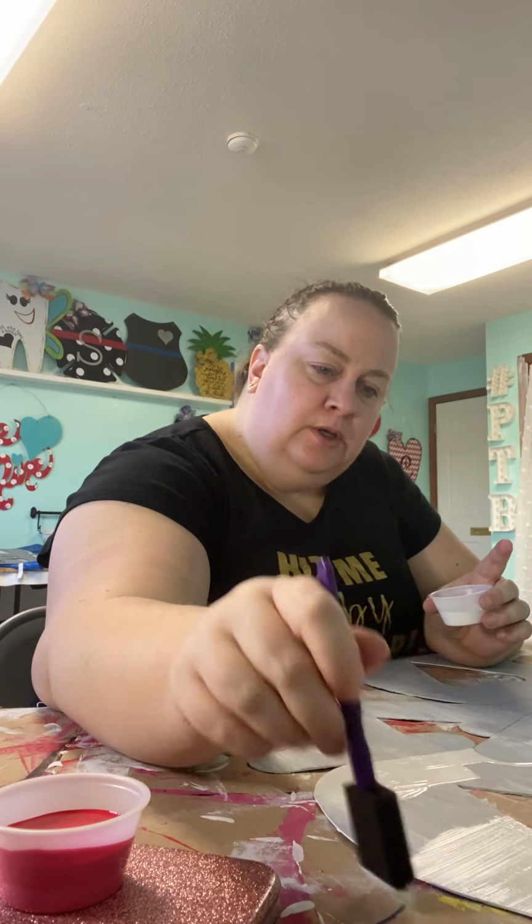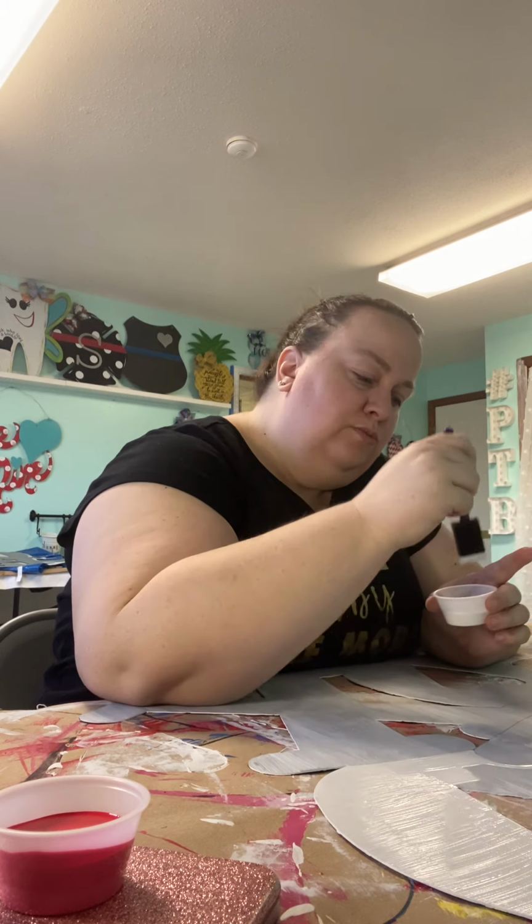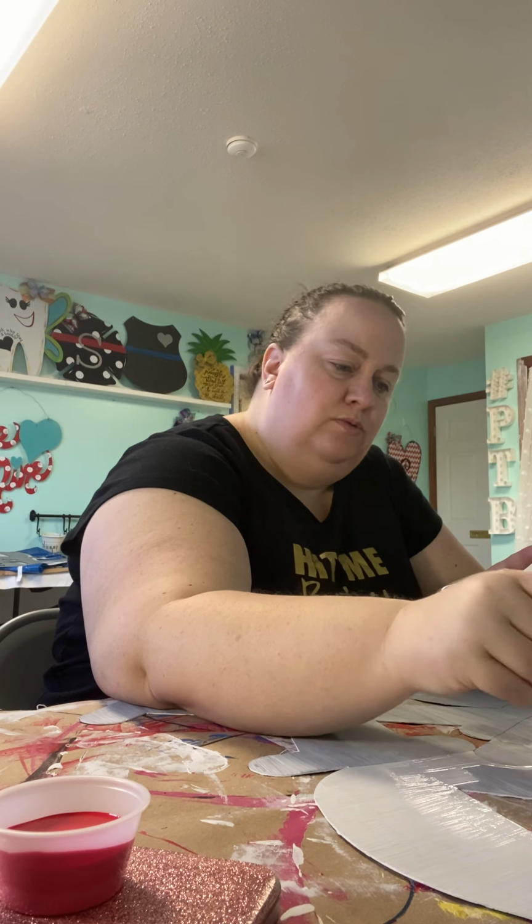We want to make sure that the paint stays smooth. So if you think about when you're painting a wall, if there's like a ridge of, excuse me, extra paint, usually the drywall will kind of soak that up. We're working with metal, that ain't soaking up anything. So you see, I kind of keep moving it, and you know, I go up, I go down, and things like that. Those are the two main tricks for when you're painting, and that'll be throughout any shape that you do here with us with PTB: keep it thin and keep it as smooth as possible.